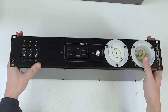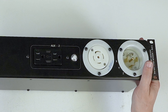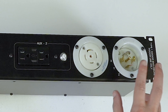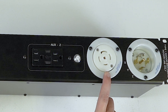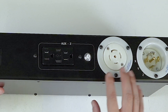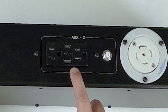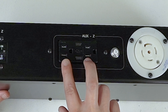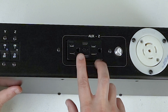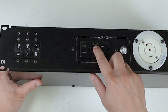The D3-2 is where things start to get a little more specialized. You still have an L2130 inlet and outlet on the front so you can link distros together. The courtesy outlet changes from a standard duplex outlet to a USB outlet — you get two AC outlets, but you also get a USB-A and a USB-C.